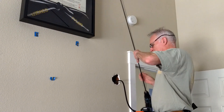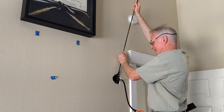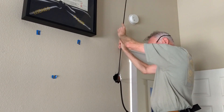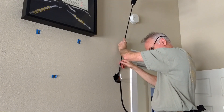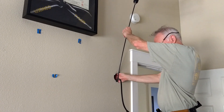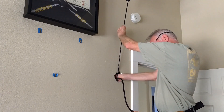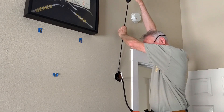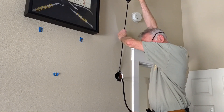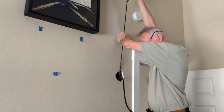I can see the fire blocking very clearly, so I'm going to drop the auger — which is really long — right down into the center. Since it's at an angle it wants to go to the backside, so I'll reach my hand in and flex the shaft to get it more in the middle. It's not exactly in the middle, but it's better. The auger is self-feeding, it's biting, and I'm through.